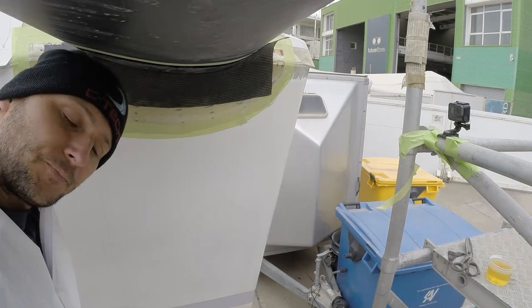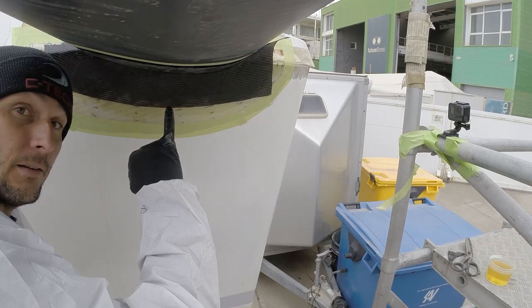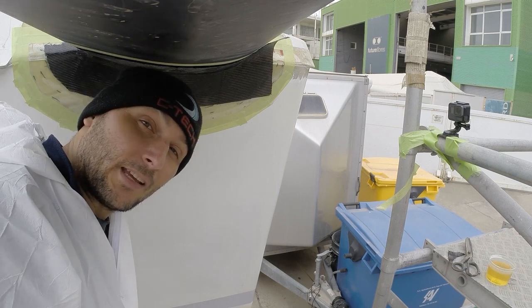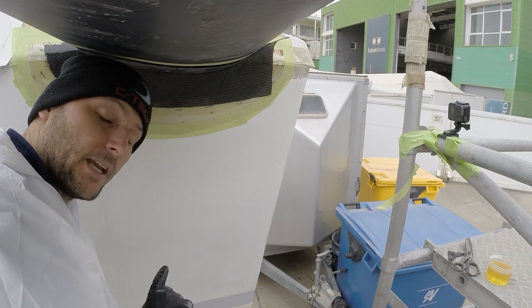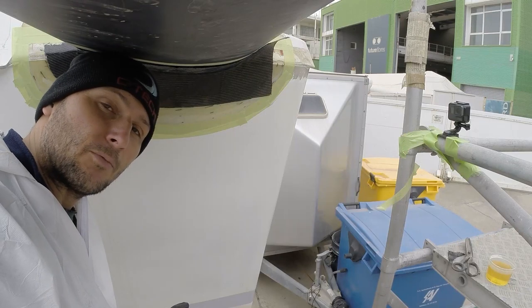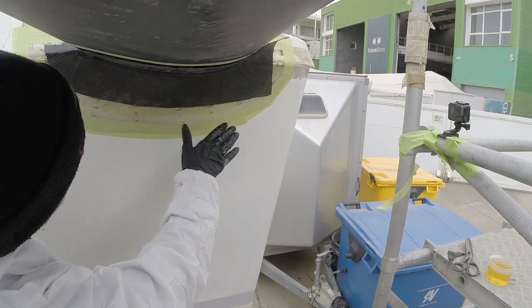So I get the laminate done, joining the front beam to the hull. And then once I've done that, I'll show more in detail, applying the stack of the peel ply, the perforated plastic and the breather felt, then putting the bag on and the techniques of putting pleats in the bag, which is really important because we have some complex geometry here.